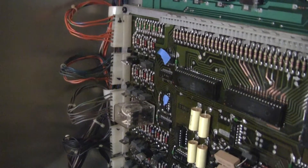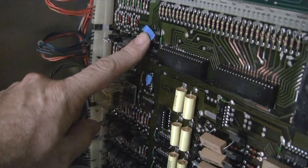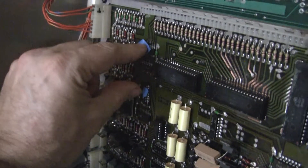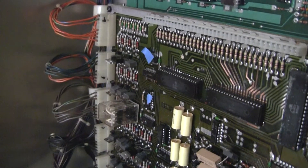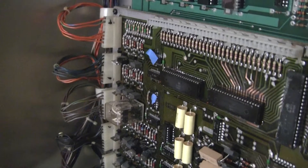So in the schematics, it passes through these two chips here. One is a 7408, and one is a 7402. I'm beginning to believe that even though I did a test in circuit just using the diode functions, there's definitely a problem with one of those chips.